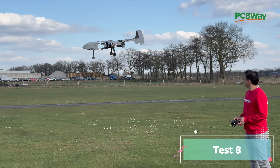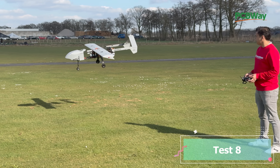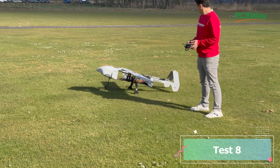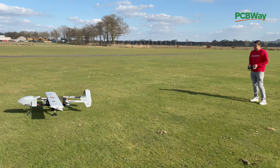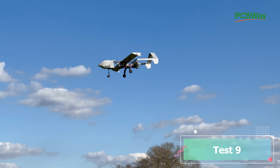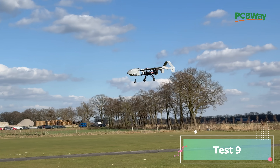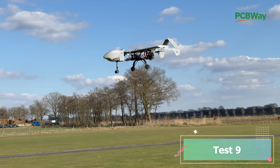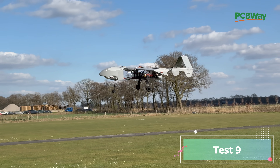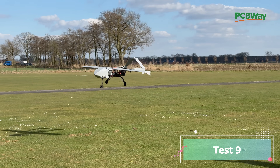You can see that the hard work that afternoon paid off. We're super happy — it feels controllable and the behavior is predictable. No crazy oscillations and she's handling well with the wind. Time for a second attempt — we're going to gain a higher climb to really escape the ground effects. We've got a really super stable hover. It feels super natural — we're hovering at 50 percent of the LiPo capacity. Marco decided to go with a two-pack 6S parallel to gain longer flight time, and she's handling really well with the wind.